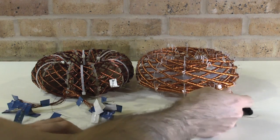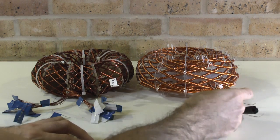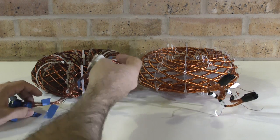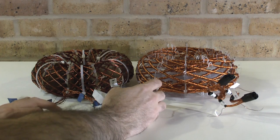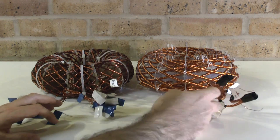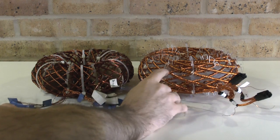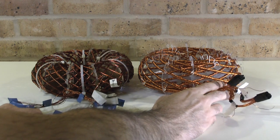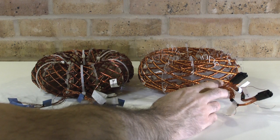I have both sides A and B, input A, input B, and so on, as it is here on Flash Grower's side. I measured the resistance of this coil. It's identical on each coil. It's the counter-running or clockwise-running coil. They both have 13 ohm, so the wire length is identical on both sides.